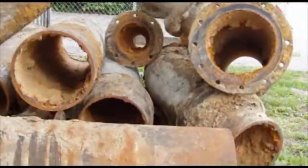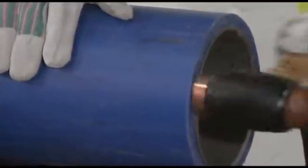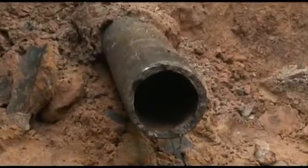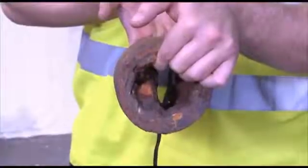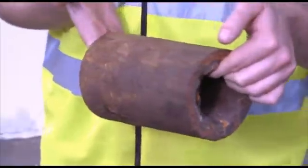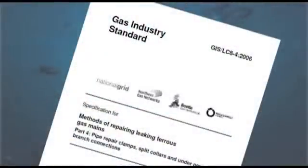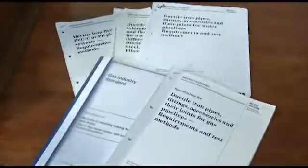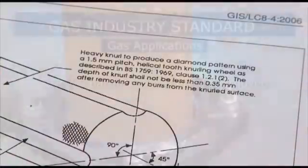In practice, however, even new pipe materials can get scratched and damaged during handling and installation. And it is often the case in repair situations that contractors are connecting to pitted and corroded pipes. So how does Viking Johnson ensure that tests accurately reflect site conditions? Viking Johnson tests its product against a gas industry standard of 7.5 bar on knurled and grooved pipe that simulates pitted and corroded conditions typically found on site.